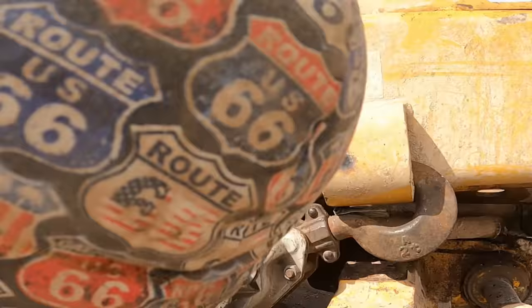So actually I might do flux core. That way, at least for the root maybe, I don't know, we'll have to see, I can pulse on and off without having to bust through it. And I'll probably bust through it anyway. But this side's looking good here. I was able to see a little bit of the way down there, but not so much.